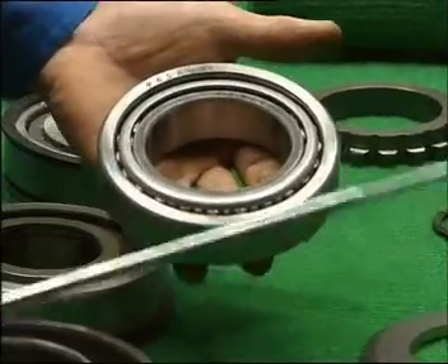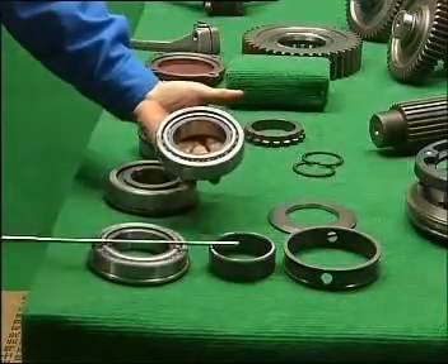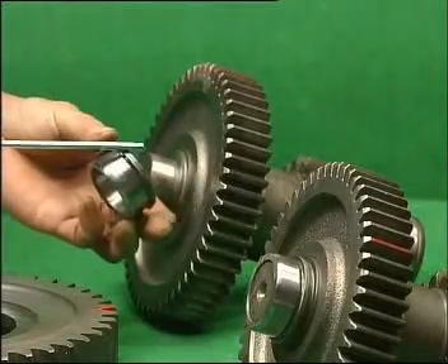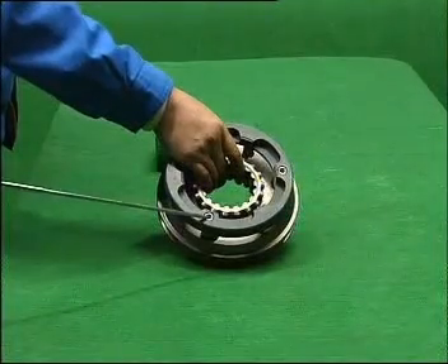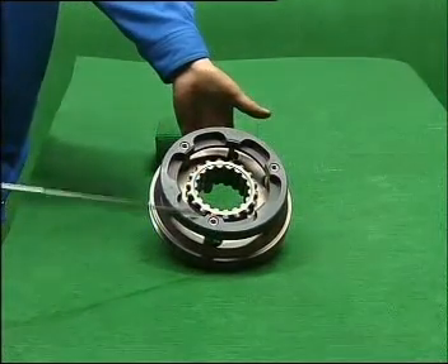The 1707109 taper roller bearing is different from the RTO-11509F assembly. The 42307E inner ring of the bearing and synchronizer assembly are also included. The yoke of the auxiliary box and the synchronizers are the same as those in the RTO-11509F assembly.